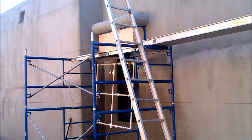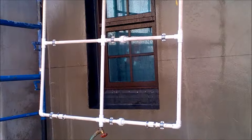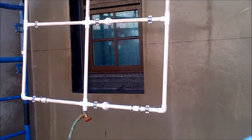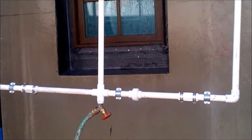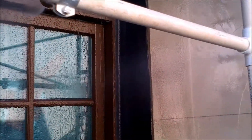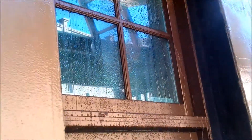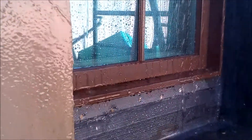This is the window on the outside that we're testing. It's the bathroom window in the back of Stan's house and that water test is going on there. As you can see, they have a little irrigation-looking apparatus here with water running in — these are just little irrigation-style heads that continue to shoot water against the window. On the inside, that vacuum is pulling on the air to act like driving rain coming in.